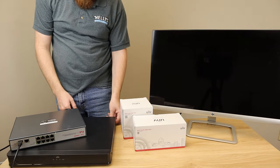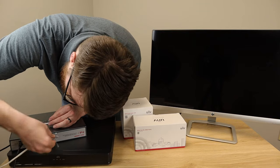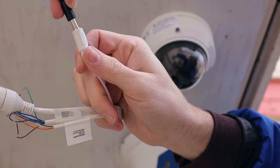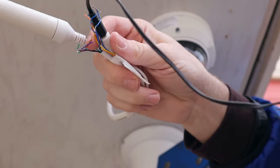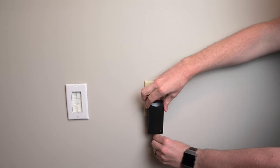You don't need an NVR to get these cameras set up. You can set it up as a standalone camera by plugging it into a switch or your router. Power over ethernet is a very simple and fast way to get your camera set up on the network — your one ethernet cable can carry both power and data. If you don't have a PoE switch, you can plug your camera directly into a standard non-PoE switch or router, but you will need to run a 12-volt DC power cable. If you don't have a PoE switch, I highly recommend picking up one of these simple PoE switches from our website — they're only about 10 bucks and totally worth it for only having to run one cable to your camera.